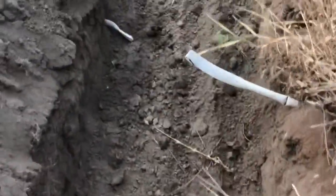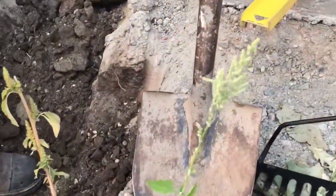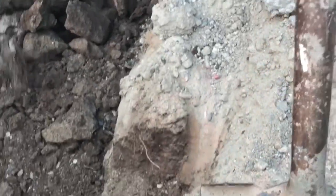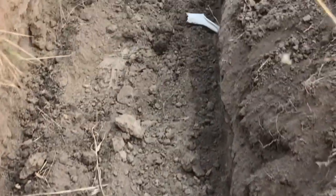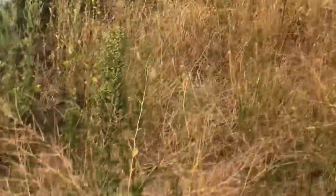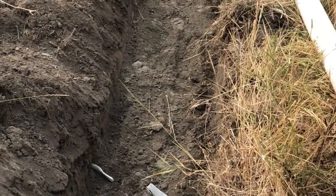To start off with, we're just doing a trench line for the drain into the septic tank. We're chipping away at the compacted sand area because the connection point is just over there. We can't get an excavator in here, so we have to hand-dig this hard sand out. We've got a 2% pitch leading into our tank area, and we're going to do an RV tie-in up above as well — we're going to tie it all into the septic tank along with the modular home. Everything's going to be tied together.